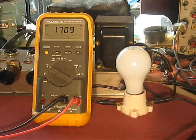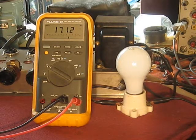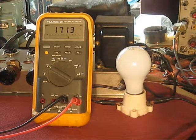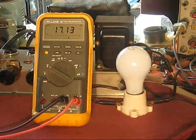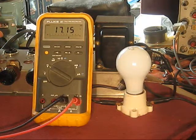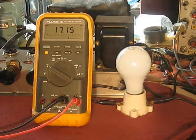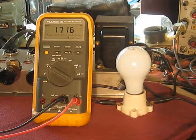Well, that section I've already isolated from the circuit, and I showed it earlier, put a small modern electrolytic, I think 35 volt rated, in there to replace that. I really don't remember if I did that replacement simply as a matter of course, which I'll often do with these low voltage ratings in a big can with the high voltage next door. I don't know if it was actually a problem with it or if it was just a matter of course. It was probably a matter of course. Meaning I just do that where these capacitors are in circuit and in close proximity in a can full of random electrolyte. It's just asking for trouble.